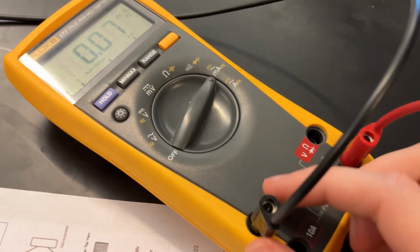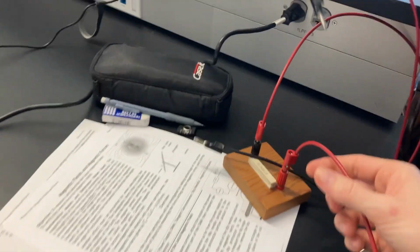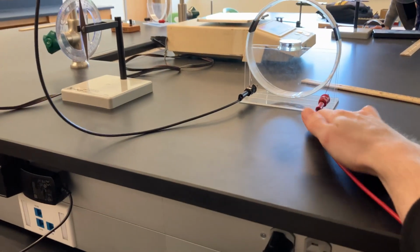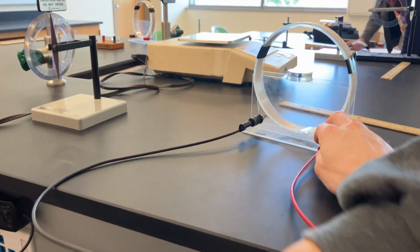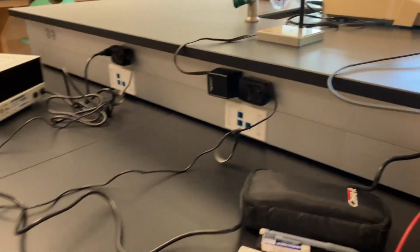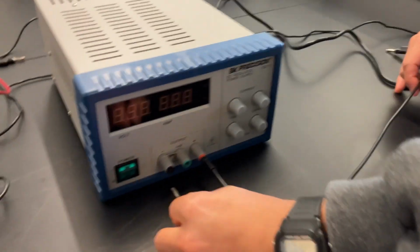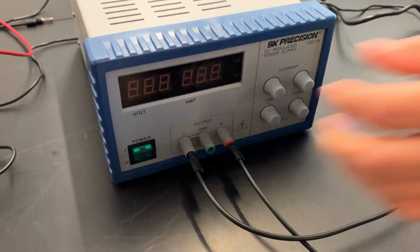So we're going from the power supply here, positive, taking that into the mA piece of the ammeter, coming from the COM, plugging that into this little resistor over here, taking that all the way into the galvanometer. Now we moved it as far as possible from the power supply that we could, and we made a little extension that we're going to plug right into the negative port.